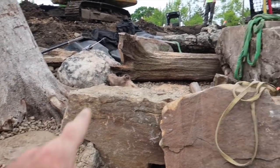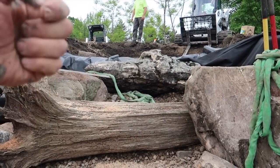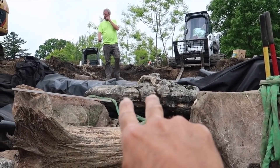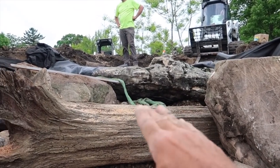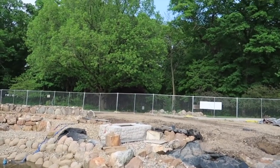The waterfall is coming together — it's all locked in place. That log looks great, and then we got this other big craggy slab of sandstone up there. We need a big rock right behind that one to act as a frame rock, which will force the water over that little edge. We're always trying to play around with how that water is going to flow, where our low spot is going to be, and where we want water to come off of. This log is very subtle — slightly lower here — and I want more water coming over on this side, getting thinner and thinner so no water goes over the back. There's still a ton of work left to do; the Forest Preserve guys are going to come in with a lot of extra work. We came out basically helping them, working side by side with their team and teaching them the entire time so they can keep the budget down a little bit. This has been a lot of fun.